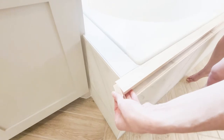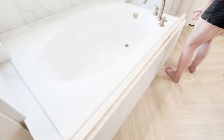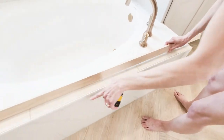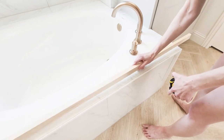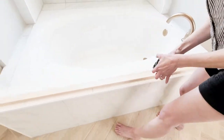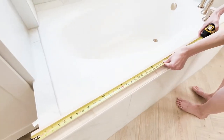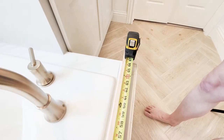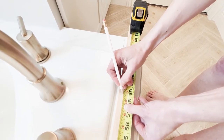You're going to want to check out your board — check the ends for any weird knot or mark. Cut that off if you can, and start with a fresh cut on one end. I'm also looking at each surface to make sure I have the correct side as the front with no scratches or mars. Then I measure out my exact length, which was 58 and three quarters inches, mark it with a pencil, and plan on cutting off the pencil mark.